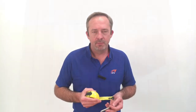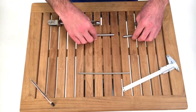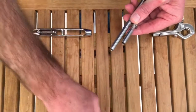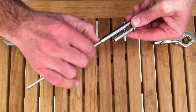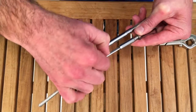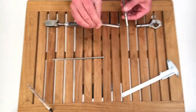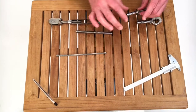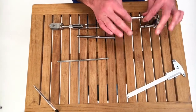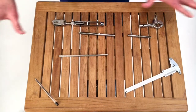I've taken the studs out — this one for lifeline, this one for standing rigging. A note of caution: the length is quite a bit longer on standing rigging studs. These are both for the same diameter, but you'll notice this area is mechanically swaged onto the wire. For lifelines there are lower loads, so they use a shorter piece. For standing rigging, definitely make sure you get the long studs. Also, with lifeline fittings there are ones that can be hand crimped, not machine swaged — stay away from those for standing rigging.